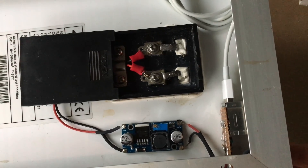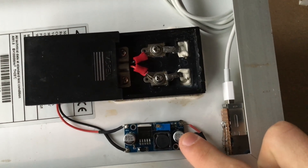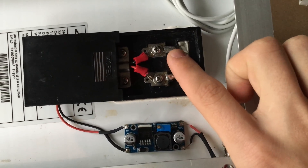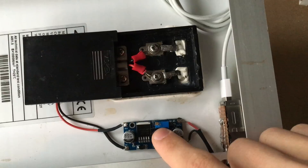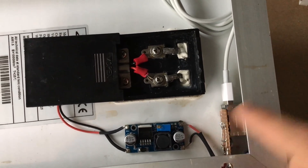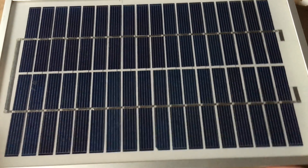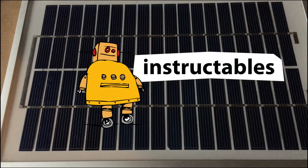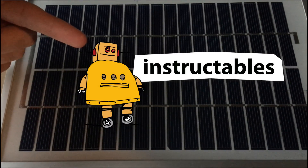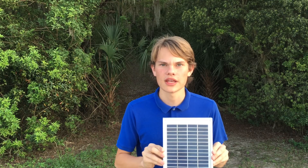You're 90% done — only two steps left. Take the completed circuit board with USB hub, along with the DC-to-DC buck converter, and attach the converter's input leads to the positive and negative of the solar panel's outputs respectively. Make sure the blue trim potentiometer is set so the output is 5.2 volts, and superglue everything in place. Congratulations! You've successfully made a solar panel phone charger that will get you out of any sticky situation. This phone charger doesn't use any batteries and is therefore perfect to pack in a go bag or survival kit.